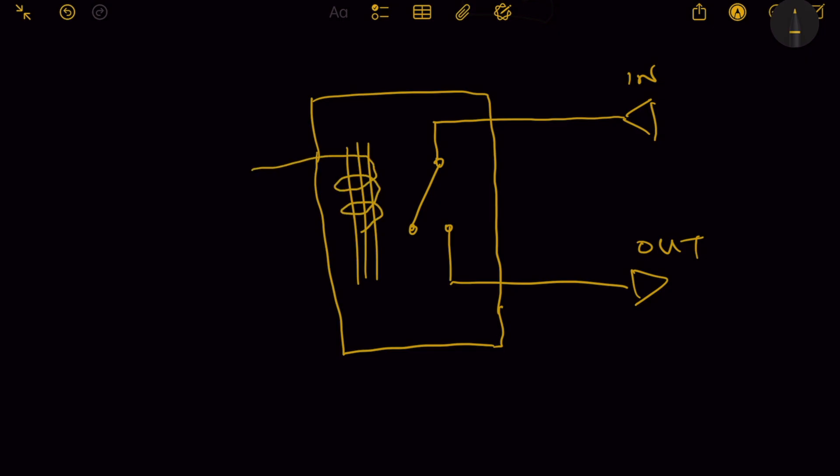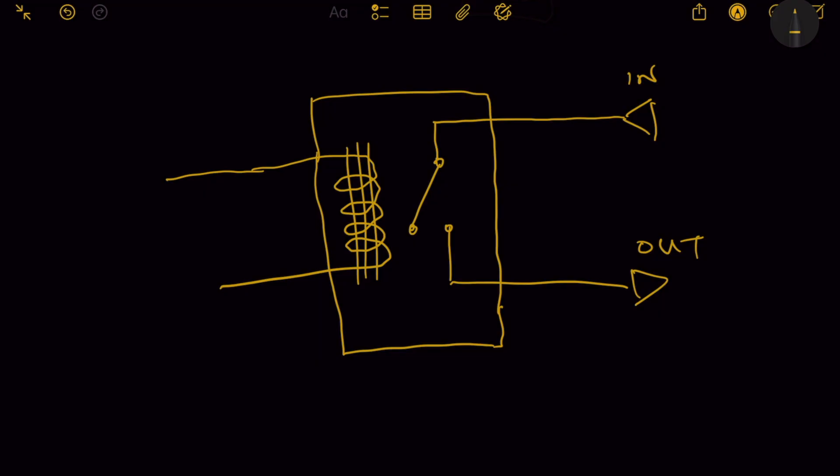Imagine a metal core with a coil of wire around it. If you run an electrical current through a wire coil, it will create a magnetic field — just the basics of electrical theory. In the relays we use in these amplifiers, preamps, and guitar amps, you're always dealing with DC relays.